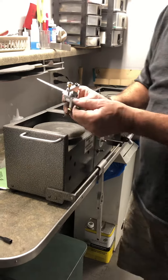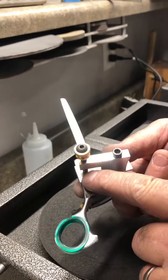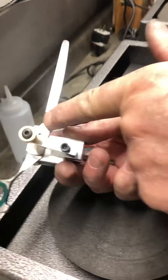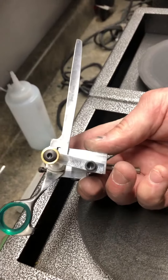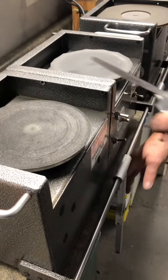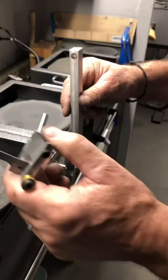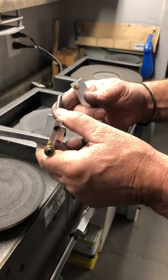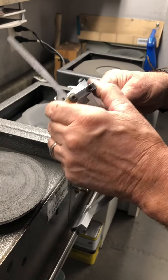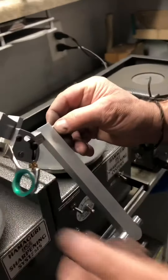I've got a right-handed shear in there, and with a right-handed shear — with all shears — I have the cutting surface up. With the right-handed shear I have the point out here to the right, just like that. Then with my clamping arm up, I take the pivot post pin and put it into the right like this, so the pin is out here hanging on the right side just like that.